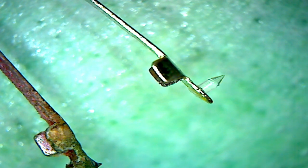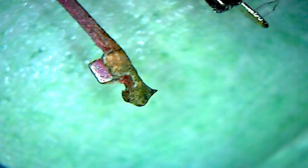So now if we finish looking at that one very closely, if we look at the other one, it would look to me like what has happened is it's worn down all the way past the needle, right down through that clear material that's clear on the other needle, and that's what you're running on. And then I'm going to guess that the needle itself isn't the only thing touching the record, that the cantilever arm back where the wings are, those wings are supposed to grab the moving part in the cartridge, and that's what's actually transmitting the groove motion through those tabs into a little fixture.